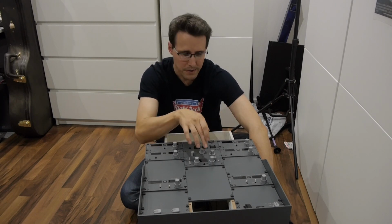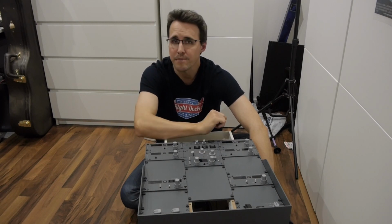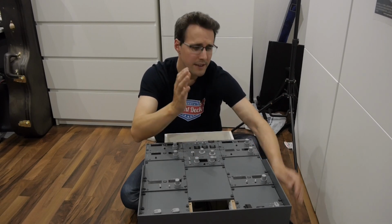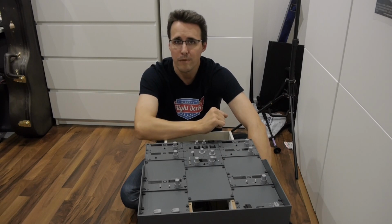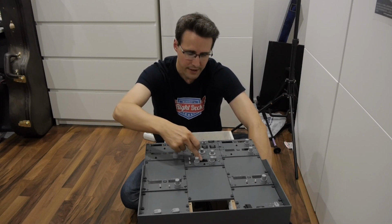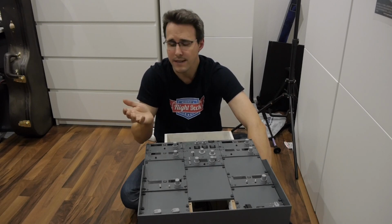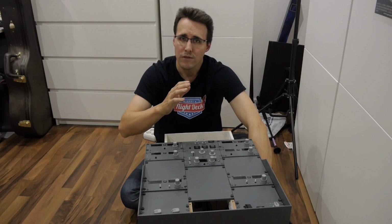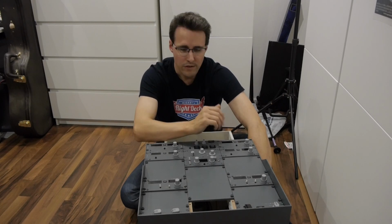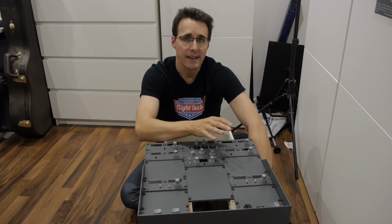One more word about the PCB I have used. You have seen me using 4 7-segment displays, but I have built in 5. This is because I have seen different versions of this panel out there on the web. Some have built a version with a leading F in front of these digits, I think for when a failure is thrown or the test button is pushed or something like this. And to be more universal, I have built in 5 7-segment displays. So if you are building your panel after my plans, then you can configure it to your needs.